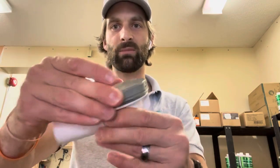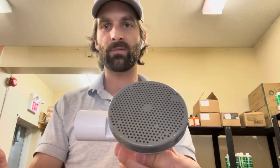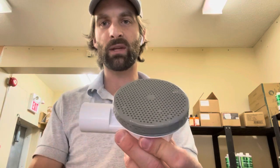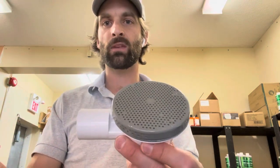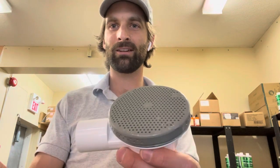And that's it. Then you try to unscrew it — you'll see the little white tab; don't torque it too hard, but you'll feel the white tab stopping you from unscrewing it. Make sure it's nice and snug. That's how you change the gray cap and maintain the floor drain on a hot tub. This is a Beachcomber Hot Tub Floor Drain. I hope this helps for whatever reason you're watching this video. Thank you.